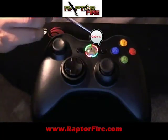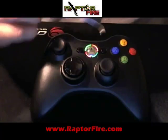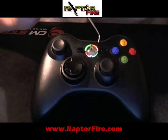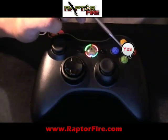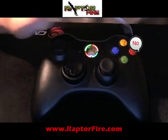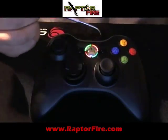Right now the LED 2 is lit up red, and I know the red is corresponding with the B button, and B is corresponding to drop shot. So basically it's asking: would you like to have drop shot available to the customer? You can answer yes or no. The green color will be answered with A, and the red color — which is no — will be answered with B. That's why at the bare minimum you have to have A and B hooked up, because you need to be able to answer these questions.